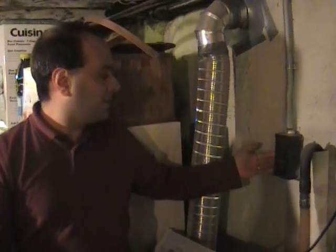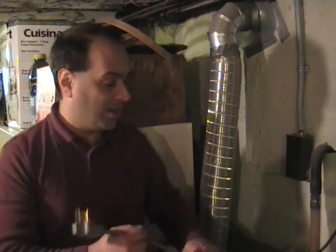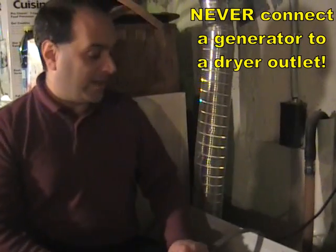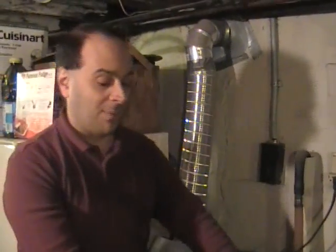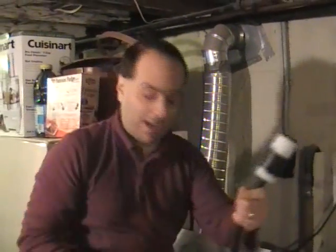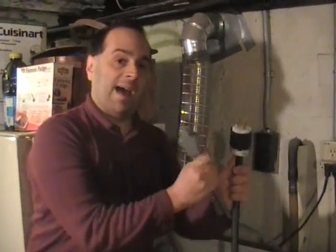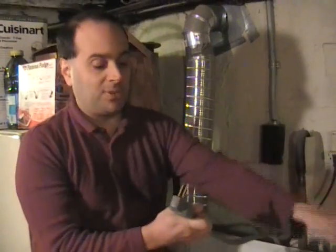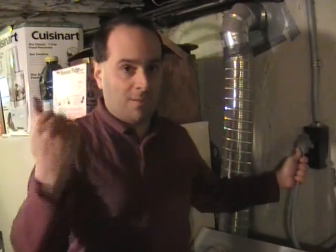This is my dryer outlet — 30 amps, 240 volts — and it exists for one purpose only: to plug in a dryer. If you've done any research about connecting a portable generator to your home, you've probably seen people suggesting you take your generator hookup cord, lop off one end, and replace it with a male dryer cord for your 240-volt hookup. This is what's known as a suicide cord. Once you plug it in, there's live voltage on the prongs, and you backfeed through here. It's dangerous — if this plug falls out or somebody trips over it, you've got live voltage ready to touch someone.